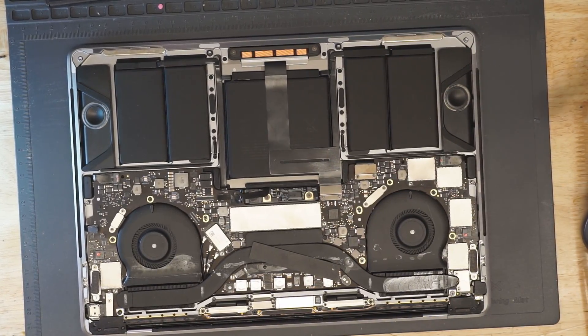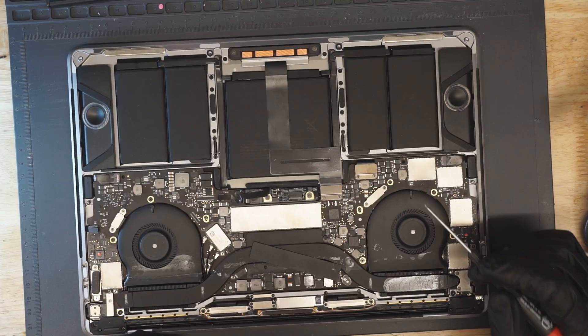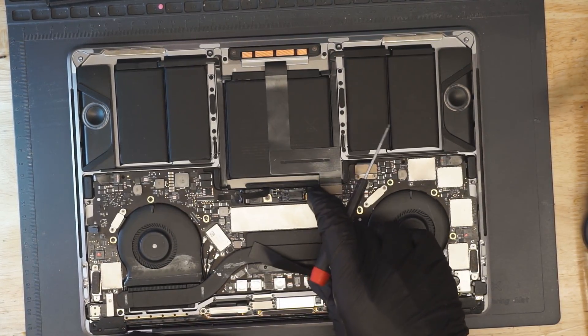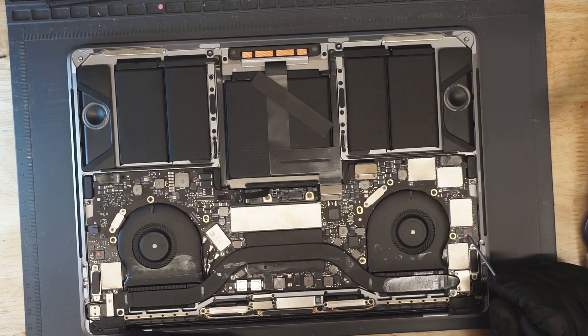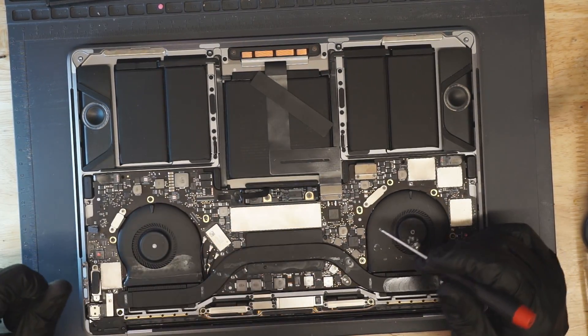What is this? What the lever-loving F is this? CD3215 — corroded. The battery sticker is on top of the CPU! Why? CD3215 corrosion. And these are under-filled CD3215s as well. With any luck it'll just be a short to ground on the cap next to it.